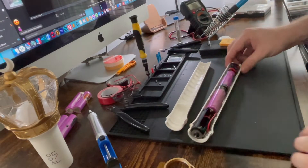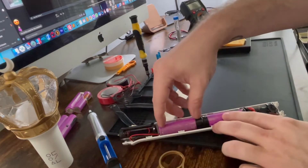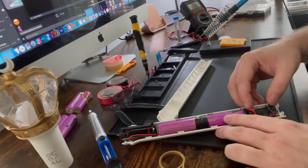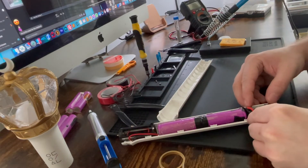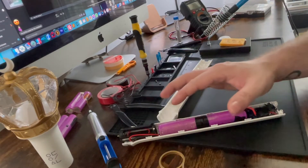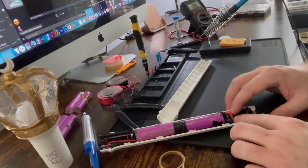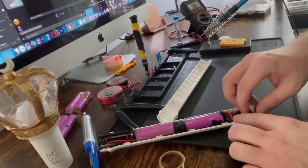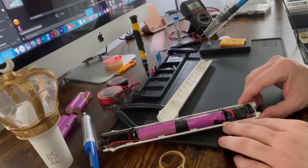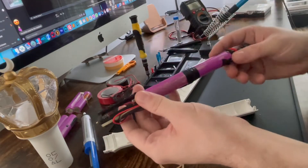This is what I was able to come up with. It was a bit of a tight fit but actually kind of perfect — two of these cells plus the length of the MT3608 voltage booster circuit gives you pretty much the perfect amount of space. You'll see I wrapped a lot of this in electrical tape because I was getting connections bumping into each other and causing shorts, so it would never turn on. I needed to insulate some of these connections as best I could. It was still kind of a rush job, but this whole piece comes out as one thing.